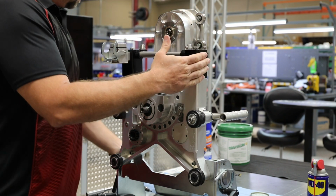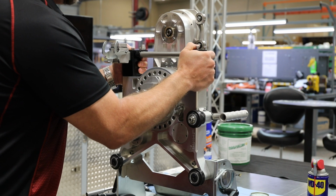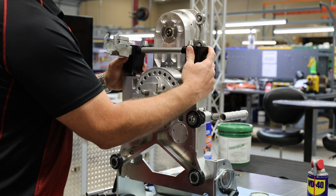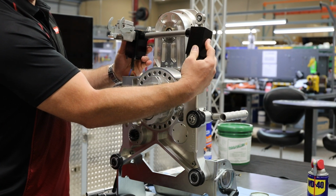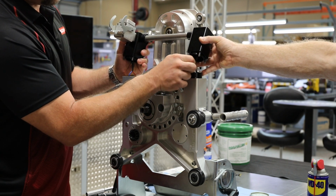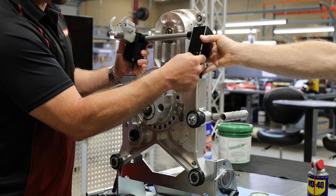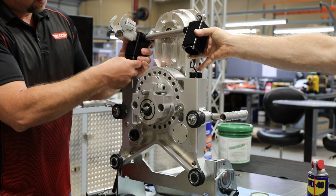Now, these housing assemblies have an O-ring on the bottom of them. If I rock them up and I'm careful, lifting straight up with just a little gentle pressure, I can get these covers removed off the top. If you have a buddy here, this is a great place to solicit his help to hold the top of these housings so you can disconnect the 2 wires on each motor. There's a red wire and a blue wire. They're blade style connectors and they're pretty easy to disconnect. But note, when we put this back together, we need to make sure we get those wires right.